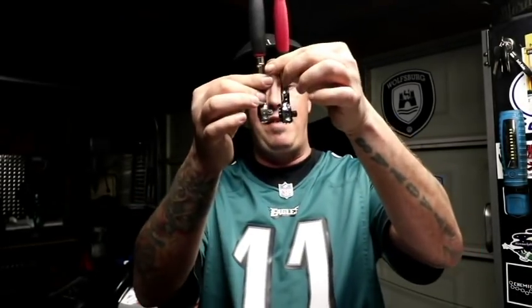Is there a real difference in gearing so far? I haven't been able to tell as far as manipulating the actual mechanism itself. It seems to be about the same exact fine tooth quality that you can expect from a high-end ratchet. Now, Icon didn't have any trouble with their 1/4 inch ratchets. They did have trouble with the 3/8 drive, which looks like they might have actually fixed. The head design is about 5 to 10% thicker on the Icon than it is the Snap-on.